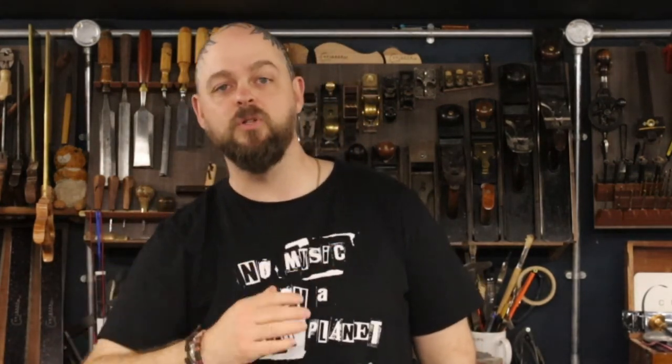Narbonne Guitars asks, how do you set the back taper on frets when leveling at the 12th fret? So you're talking about fall away from the 15th or 16th fret onwards. You want a ramp going down towards the top of the guitar, it just makes everything play better. Essentially what I do is put three layers of masking tape across the 11th and 12th fret, and a piece of masking tape on the back of half of my leveling beam, and that tilts the leveling beam at that angle, and you just go and you're done.